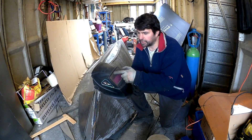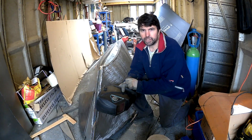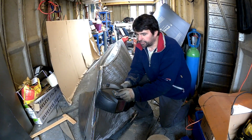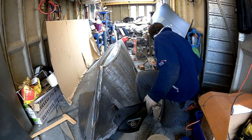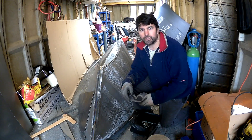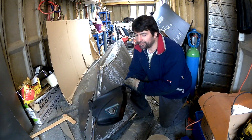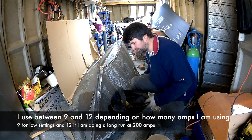This is a standard welding mask with auto-dimming, but it also has a grinder setting. I can set it to that and use it for both grinding and plasma cutting, since it's still dark enough for plasma cutting as long as you don't look at the plasma too much. All the grinding dust falls off the mask, whereas if you use normal goggles the grinding dust sits around your forehead and when you take them off it drops in your eyes — so with goggles I'm always getting bits in my eyes, but with this mask I don't have any problems. I have to turn off the grinder setting and set it up to about shade 12 for welding, and that's pretty good.